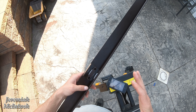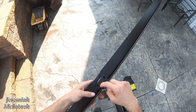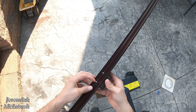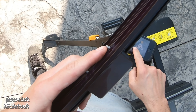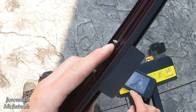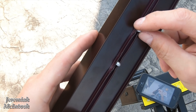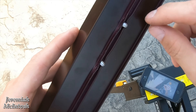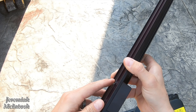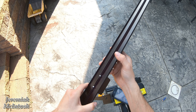This is where I'm modifying the directions. The instructions want you to drill down through the threshold for two screws to hold the center guide. I'm not a fan of drilling through the threshold — it creates a path for water to get in, and the screws only go through a little bit so they won't hold much. What I did was take a pair of pliers and squeeze the guide tabs together a little so the screw has more to grab onto, then I'll cut those off with a grinder.